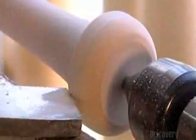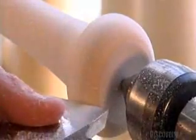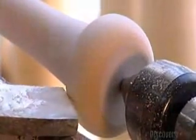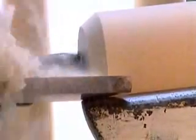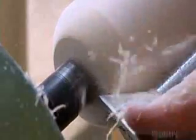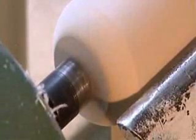He slims down the handle a little more. Then he angles the top of the knob with the chisel. He shapes the rest of it with a square-end chisel. Next, he curves the bat's barrel using the same tool. This gets rid of sharp edges that would cause a ball's impact to ripple down and jar the player.